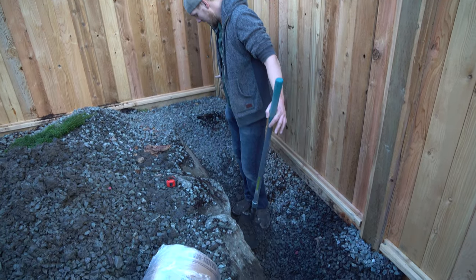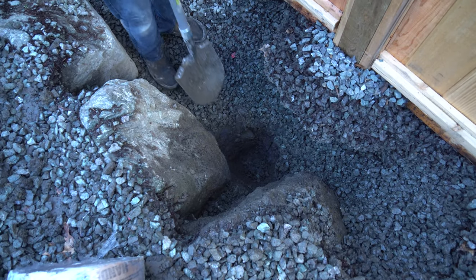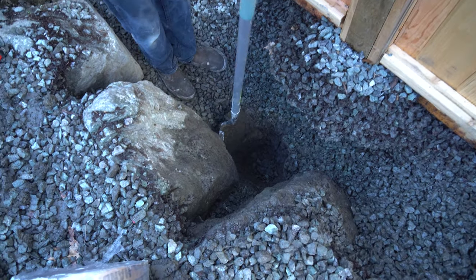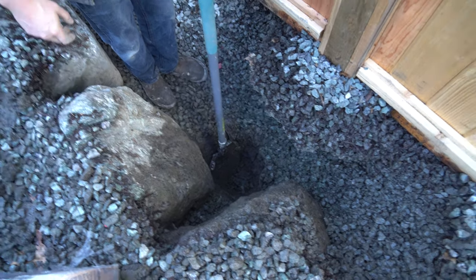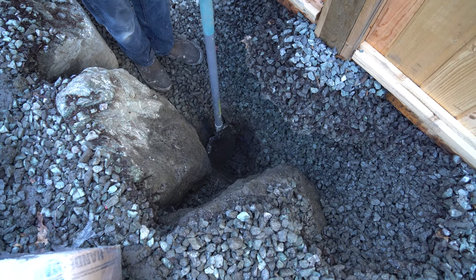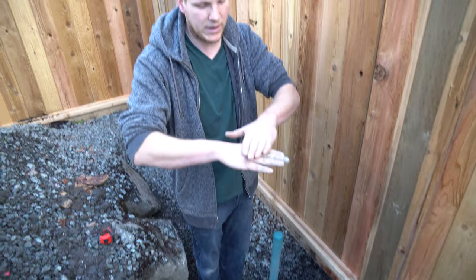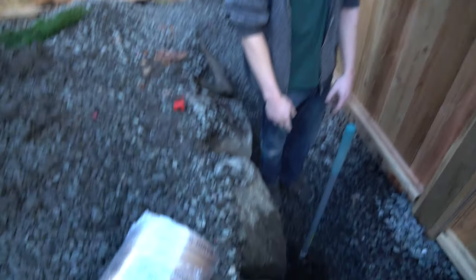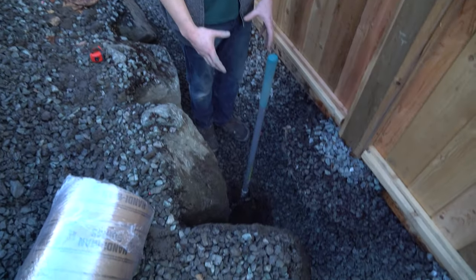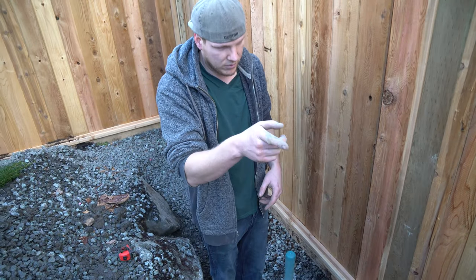As you can see, I'm in the hole. I dug even deeper — we are at 4 feet. The plan now is to dig a little bit deeper because as I dig, some of this gravel is going to fall in and we'll use that as a plate to level it. Then I'll drop the sono tube in the clay, and after that we can fill it full of concrete.